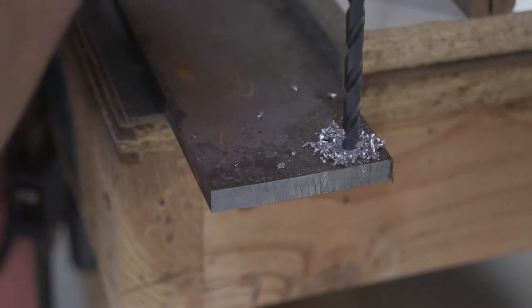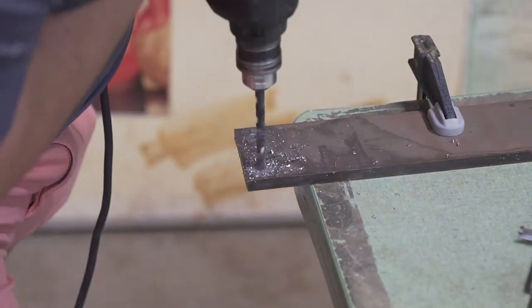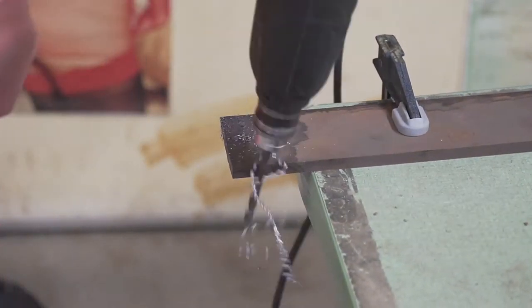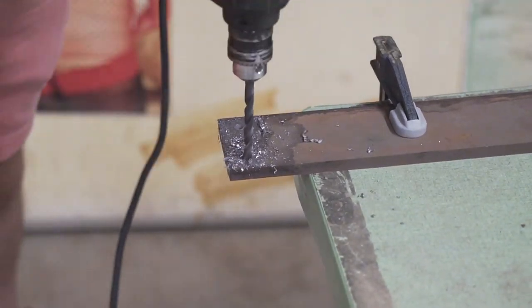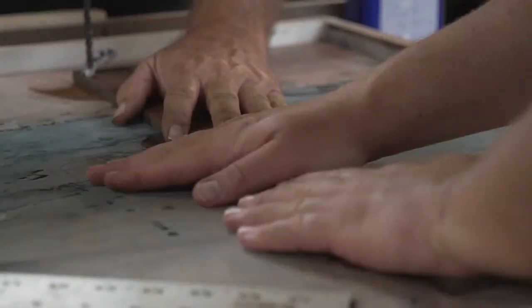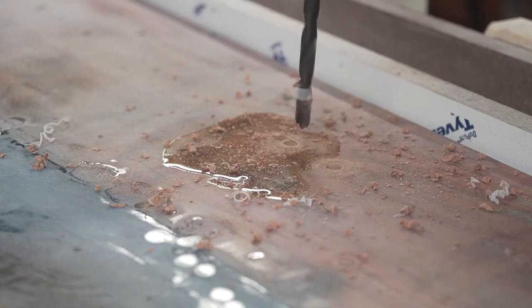So now that the main pour is done, I probably need to explain a couple of things. I wanted some bracing for the underside of this desk for added stability and to minimize the chances of it cracking where the epoxy meets the wood. I also needed a good place for the mounting brackets that came with the legs I bought for this desk, and I didn't want to screw directly to the underside of the desk for these legs because that would have meant half of the mounting hardware would have been going into epoxy.